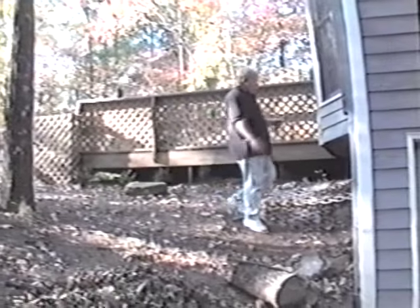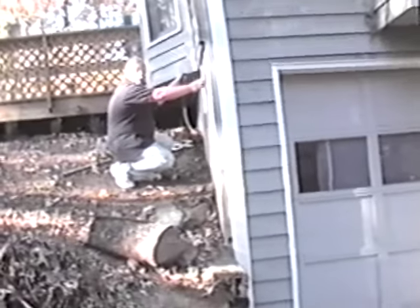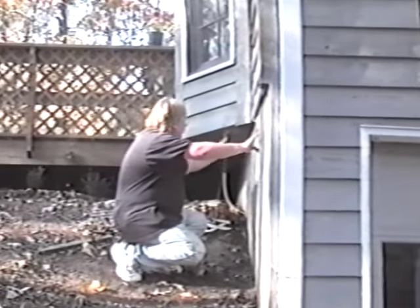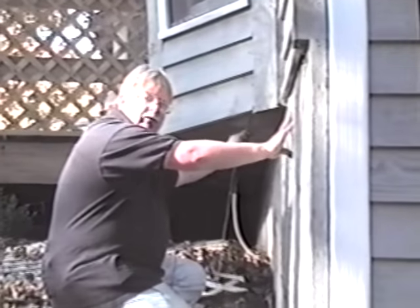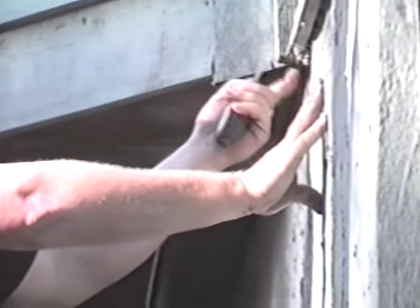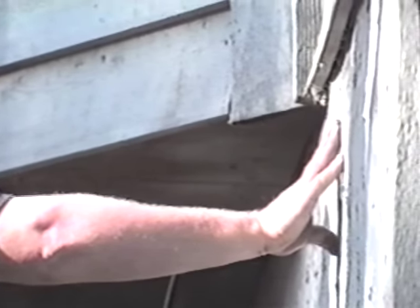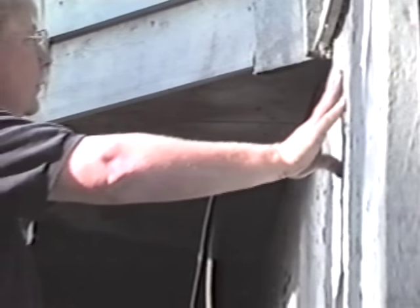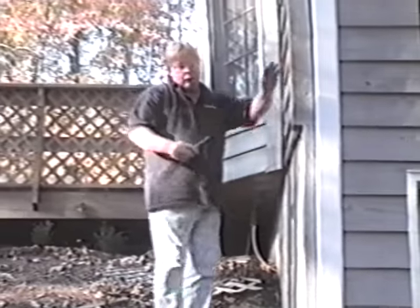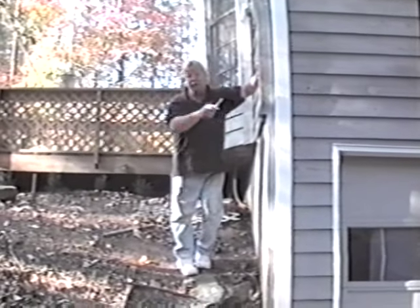Once again, what you'd want to do is look underneath, make sure that you have concrete before wood, which we do, and then you'd look underneath bay windows and things of that nature, and make sure that you have a good solid piece of wood under there. Whenever you have any exposed pieces that are cut at the bottom, make sure that there's no sign of entry. You want to look for sawdust as always, and holes in there, and everything will be just fine. Remember the soft exposed woods here, to make sure that there's nothing getting in.